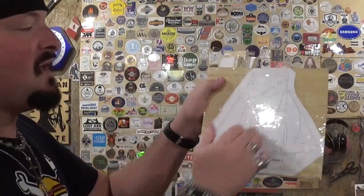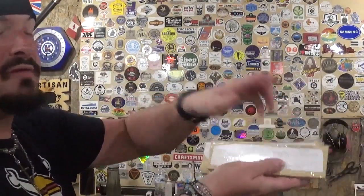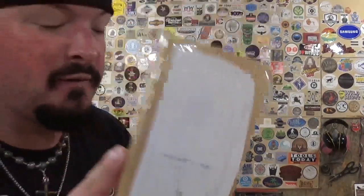The middle layer of the boat, which has the sails, rigging, and all, is just one single piece of quarter-inch material, and then we have the two sides. Once everything is glued together it's really going to look like a sailboat. With a multi-part project like this, I have a picture from Steve's pattern pack saved to my phone so there's no guesswork at assembly. I'm using Revolution Ply from Lowe's, so this quarter-inch material doesn't quite measure a true quarter inch — I've redrawn the cut line for the tabs on the base supports. Let's head over to the drill press to drill all the pilot holes required.